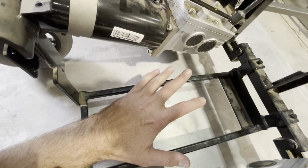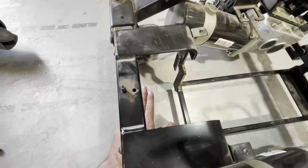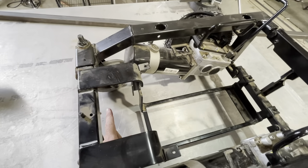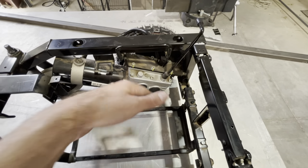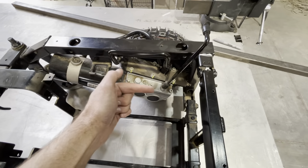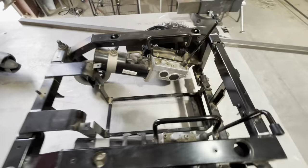Mounted to this tray area I'm gonna have a V-shaped, cup-shaped plate steel on a pivot. It'll pivot down and set low to the ground. I'll probably have a little roller in front of it — maybe a half-inch or five-eighths roller, or some bearings stacked up — to allow the wheel to roll up onto that plate. Once it's on the plate, I'm gonna have a linear actuator on one of these sides that, with an arm, will pull this V-shaped plate up so the wheel is kind of captured in a little cradle. That's my plan for now, and I'll iterate from there.